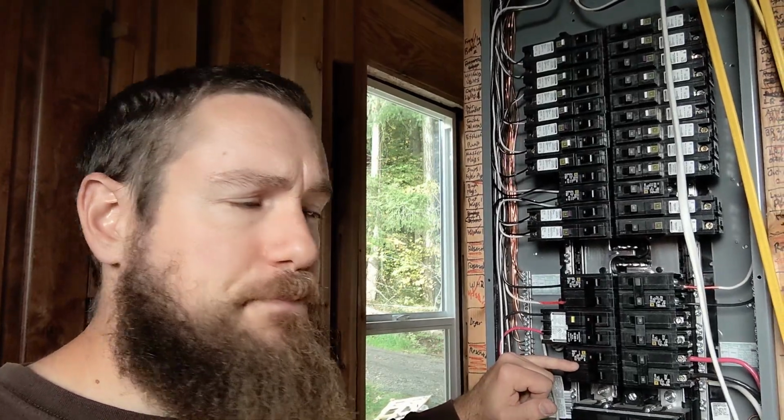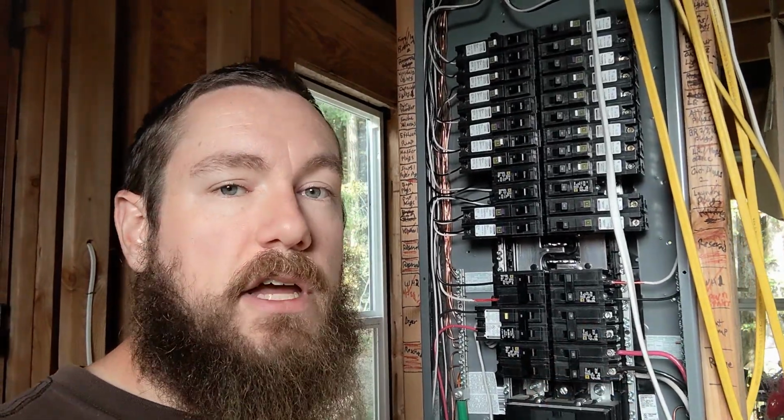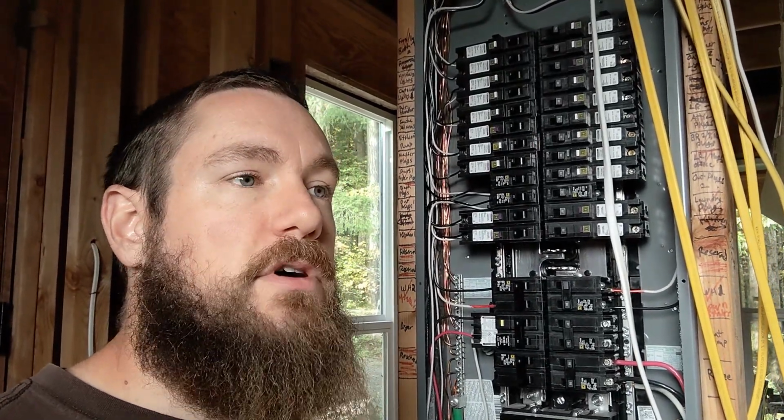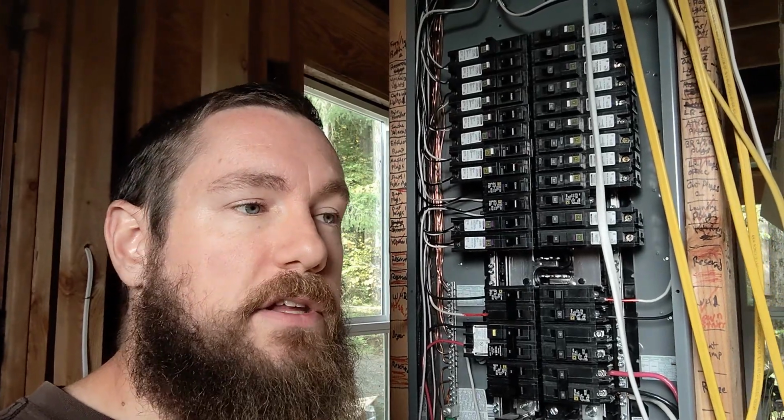It's just a 10-2. And then on the other side, we have a 35 max ampacity circuit breakered off of a 40, and the wire therefore needs to be an 8. So that's also just an 8-2, nothing more extreme than that. That one is going to have to head all the way across the building and then pop down and out of the building. So we'll have to use a junction box and then transfer it out into either conduit as a different type, or I suppose you could do direct burial. Probably we're just going to push it out in conduit and then run it over.